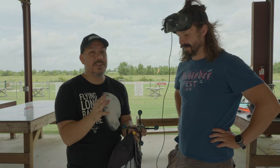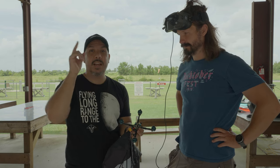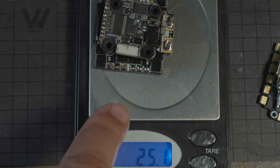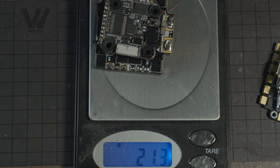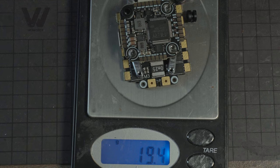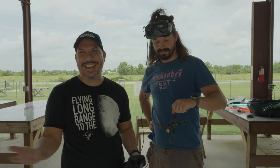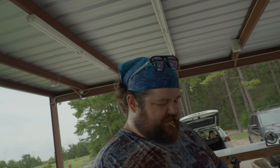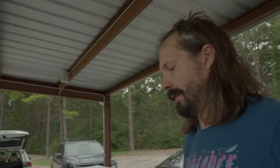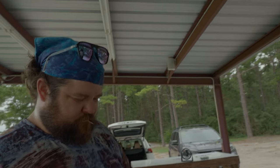It's only three grams, and your gummies weigh 0.7 grams, so it's only 2.3 grams net. Here's the Foxeer Reaper ESC — the big one with the Foxeer Reaper flight controller — at 21.3 grams. Here is the Team Black Sheep ESC and flight controller at 19.2 grams, so you actually end up saving weight. It's a premium race-worthy stack at 25 grams counting everything. I honestly wouldn't mind if this ESC were a little bit wider but with a regular 20 by 20 mounting.